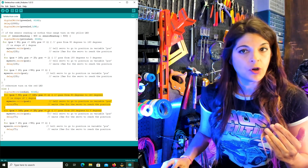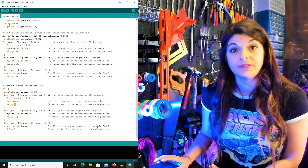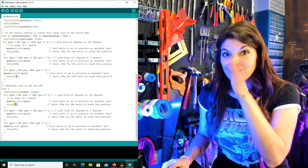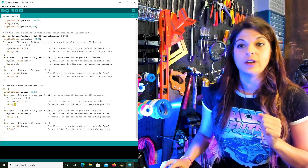For the red condition you'll see the same servo code, except one difference: seven milliseconds here versus 15. So the nose is going to move a little faster. I thought that would be a cool differentiation, other than just the LEDs, for us to know something serious is going on.